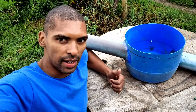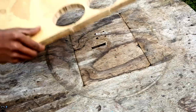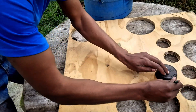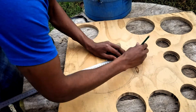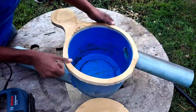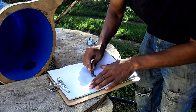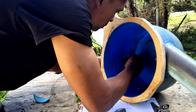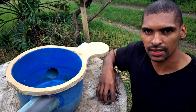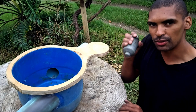While that silicone is drying, I'm going to cut out a wooden frame that is going to go over the bucket and hold the motor. I traced the dimensions of the bucket onto a piece of plywood, made another circle to hold the motor, made an outline of 1 cm, and jigged it out. The part that is actually going to generate electricity is going to be this little wiper motor. I'm going to drill a hole and mount the motor.